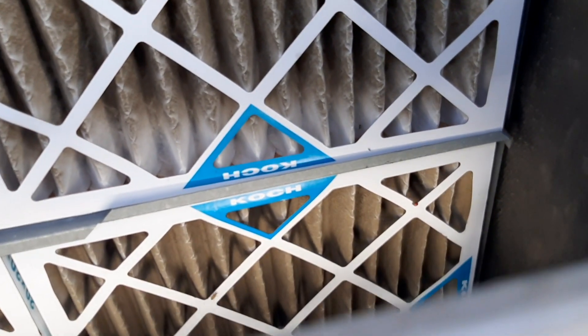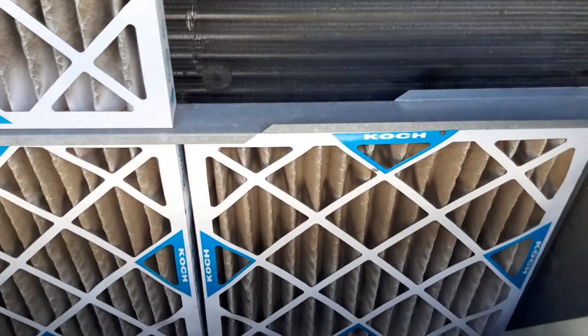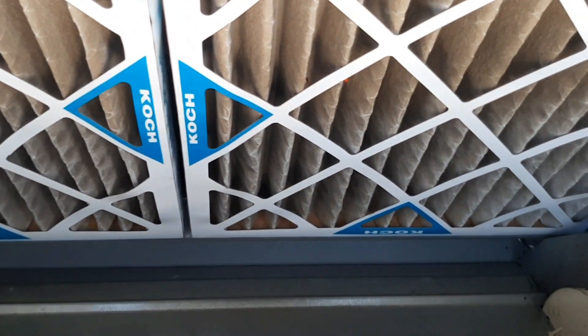Filters are dirty. I don't even see light though — it's not terrible. Those are even worse. The damn economizer is open. That's my return right there, James — it's almost 100% open.